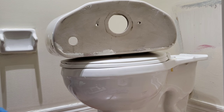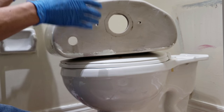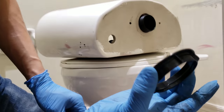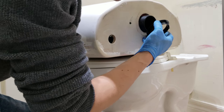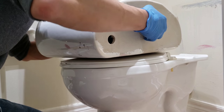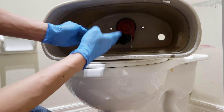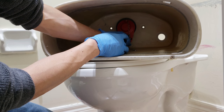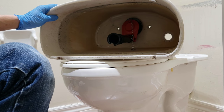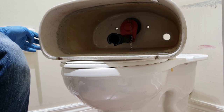So first thing first, gonna put this thing on. So just slide it right through. Take the spud ring, the retaining nut, spud ring, whatever you wanna call it. Spin it in if it doesn't come up. Okay, don't tighten it too much yet because you need to make sure this thing's angled properly. You want like 90 degrees, perpendicular. Yeah, whatever, 90 degrees.